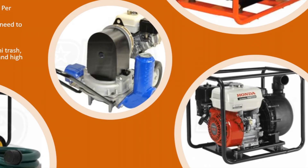The one in the middle here is a diaphragm pump. If you're pumping sewage, thick stuff, or sludge out of the bottom of a pond — anything thicker than water — this is the pump you want. Rather than an impeller rotating on a shaft like the other pumps, this pump has a diaphragm that moves up and down on a cam from your engine. On the upstroke it pulls water in; on the downstroke it pushes it out the other side.